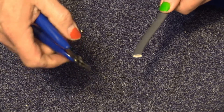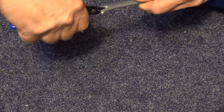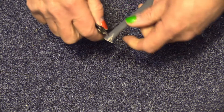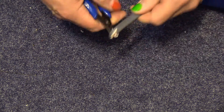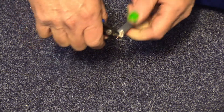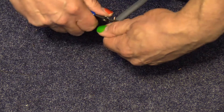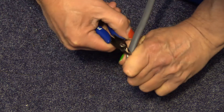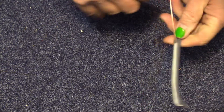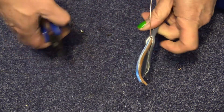Morning. Twin and earth cable — the usual way to strip one is with a pair of side cutters. You strip it, cut the middle, twist it to get the earth wire, grab the earth and pull. Then obviously to get the inner cores you've got to fold back the sheath and trim that off.